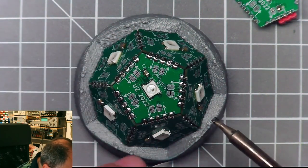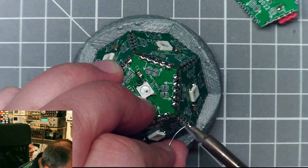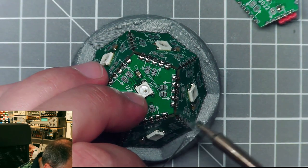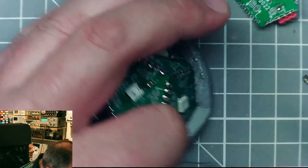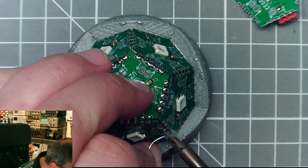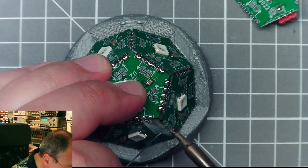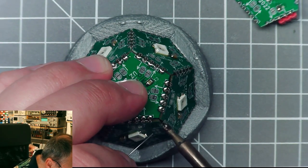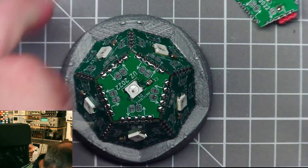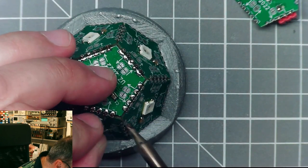I haven't bothered to clean the boards themselves yet either, because I knew that I would add more solder and more flux residue will automatically be there. So if I'm going to clean the boards, I will do it after I'm done with all the soldering. I'm not even sure if I'm going to clean. Both the flux I used for the SMD mounting and the flux which is inside of the solder wire is so-called no clean flux, which actually doesn't need any cleaning necessarily.